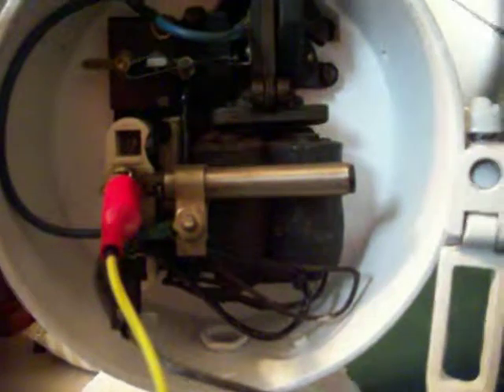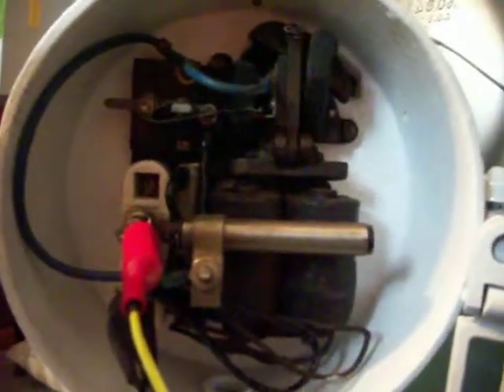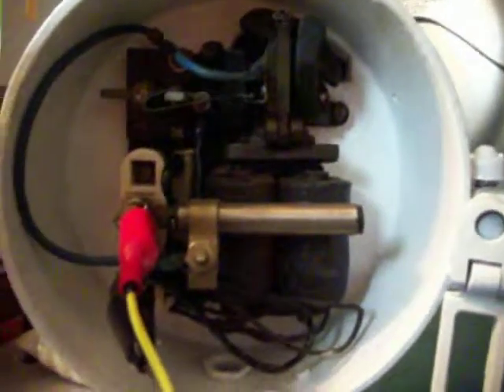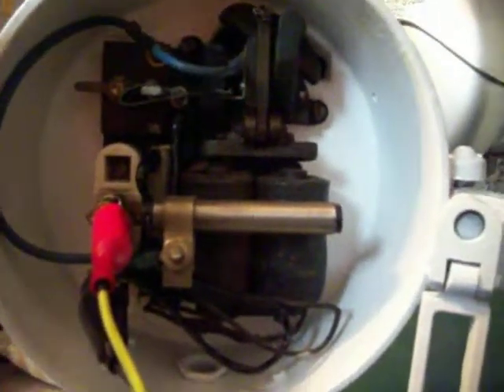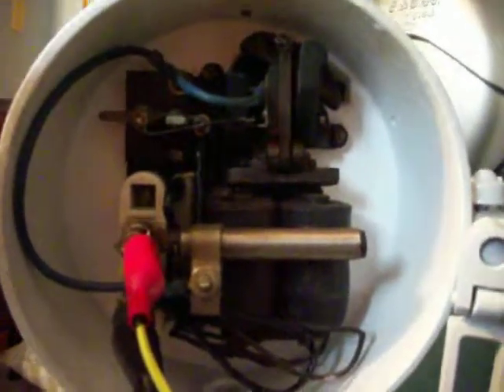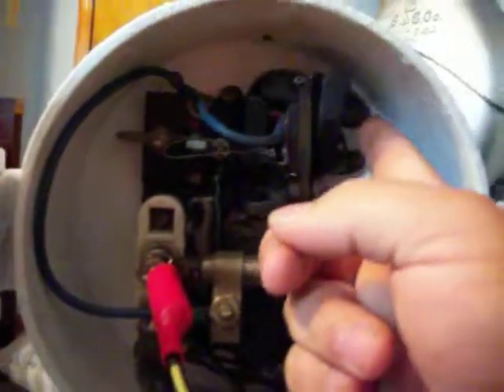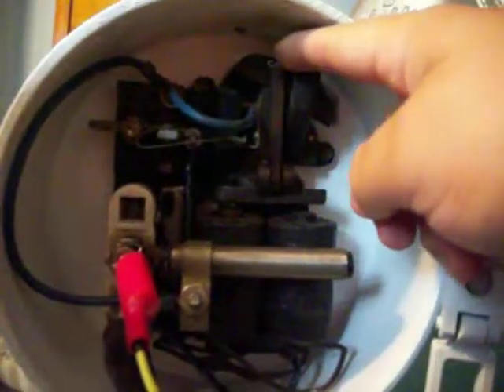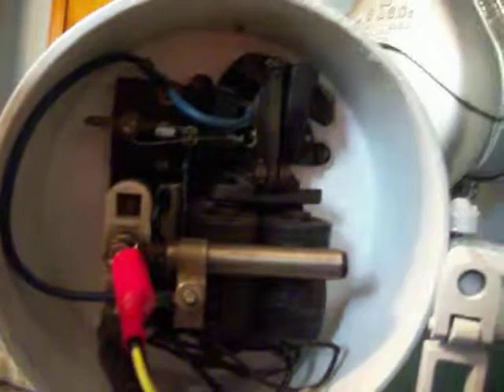I completely reworked the inside. My biggest problem as to why it wasn't ringing properly is because this thing was either in a fall or an accident at one time, and a lot of work was done to it by a maintainer. There was improper hardware in here, and the hammer piece needed to be adjusted, and this whole part right here that the hammer connects to was warped, so this cotter pin was in but the one on the other side wasn't. Nothing lined up.